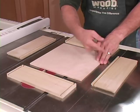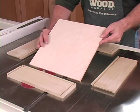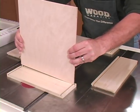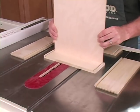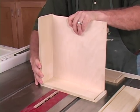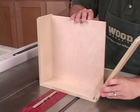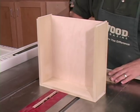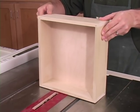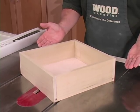After cutting all of our joinery, I dry assembled a drawer and cut the bottom to size. Now let's see how it goes together. I add the bottom to one of the sides, slip a front or back on, add the other one, and now I can add the second side. We've just done one-setup lock rabbet drawer construction.